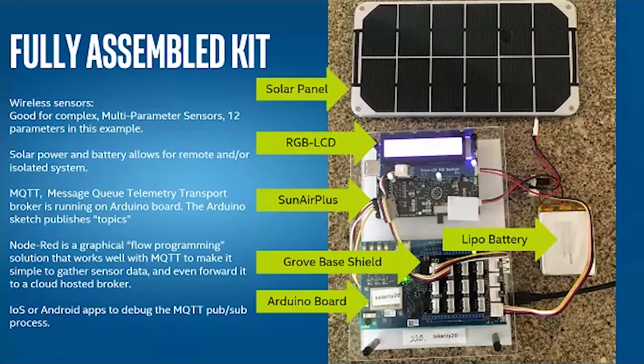One reason for going with a wireless device is that it can transmit more than just one analog value — you can send a complex set of data. For example, a three-axis accelerometer with X, Y, and Z directions would need three analog sensors wired. With MQTT, we can subscribe to multiple topics, and in this instance we have 12 topics coming out of this sensor assembly.